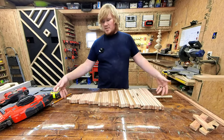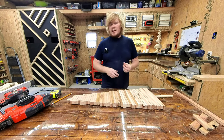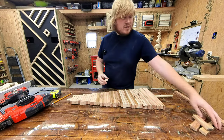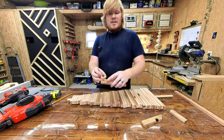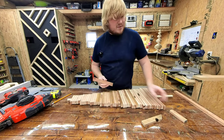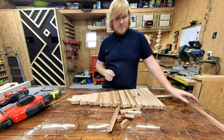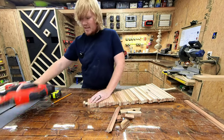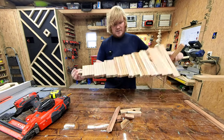Go ahead and get all of your pieces skewered onto your dowel rod — I struggled quite a bit with mine; the entire thing could have been its own blooper reel. So with that, I created this little topper piece. All I did was take a piece of scrap wood, drill a hole at the very end of it, then cut it off at the miter saw to keep your hands at the farthest distance available. Make this little guy — he just gets popped onto the end and then nailed into place with just two nails, one on each side.